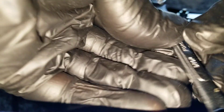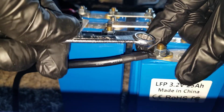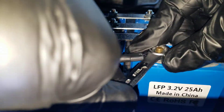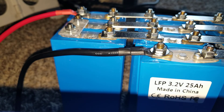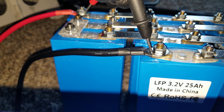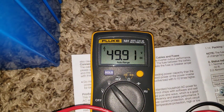We eliminate one battery — instead of 16 it will be 15 batteries. Actually let's do 14 batteries. With that configuration, the inverter should see what looks like a full charge battery bank. We already got this in place, so let's put the probes back and test the voltage on the Fluke. We're reading 49.9 volts.